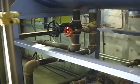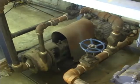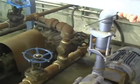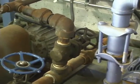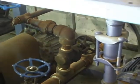The smaller pump pumps boiler feed water to boiler B through that line. There's a normally closed pump A-B bypass valve here so that if either pump fails, we can still put boiler feed water into either boiler with either pump.